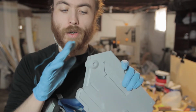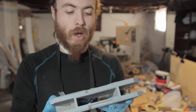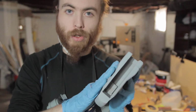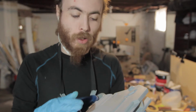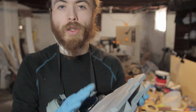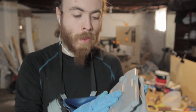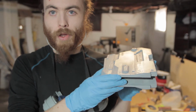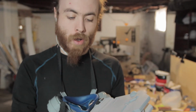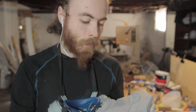Okay, so it's a couple days later and I've finished refitting the front of it right in here so that it fits into the chamber and the grip. And then I repaired any damage that I'd done during that process and re-primed some filler primer too, taking it back to the stage we left it at, where we'd just done the final coat of light primer and wet sanded it down. As you can see, that's the stage we're at now. So I said then that the next stage is dark priming, so that's what I'm going to do now.